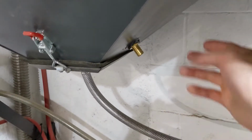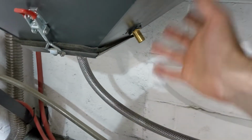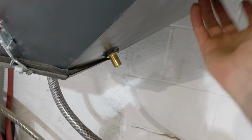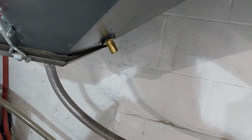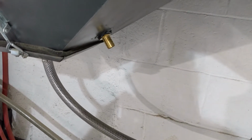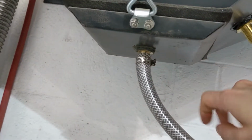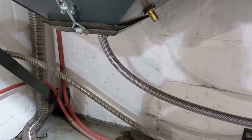And the reason for this is that as the hopper would empty, or as it was circulating, I would end up with a cone that went the whole way down and nothing would be falling into this, because that coal slag kind of sticks to itself a little bit. It just doesn't flow as well as you think. So anyway, I moved these into the bottom of my little hopper doors so that everything in that hopper is coming down to here. It makes sure that the media is flowing better.